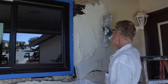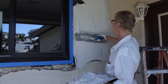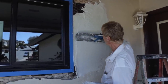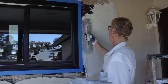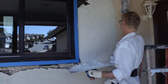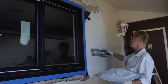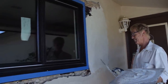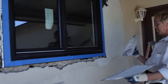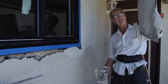We're going to fill this out to the grades — meaning this wall and this window gets about a quarter inch reveal. After I finish plastering, I'll take my trowel and use it as a rod here, so I can get it almost true and plumb without doing much else. This will take about half an hour to set. This particular stuff is really sticky — I mean, that's how sticky it is.